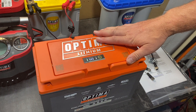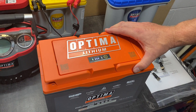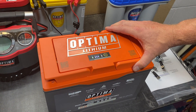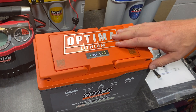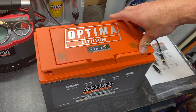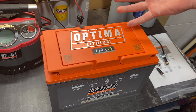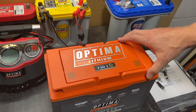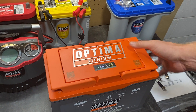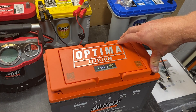The operating temperature for this battery goes from minus 4°F up to 131°F. Charging temperatures range from 32°F up to 113°F. With lithium batteries, you can sometimes put a load on them — turn on lights or accessories — and that will help heat the cells internally, allowing the batteries to warm up so you can use them in slightly colder temperatures.